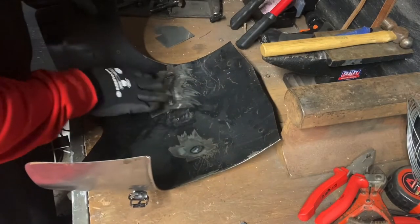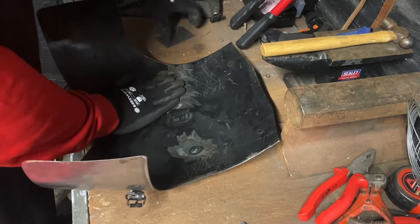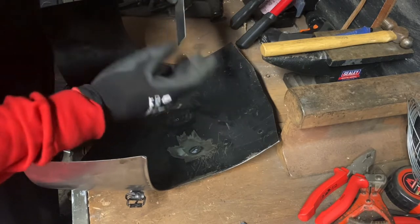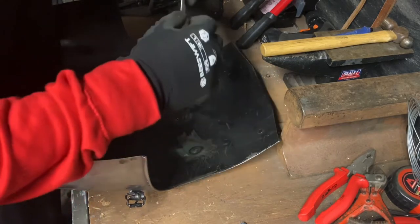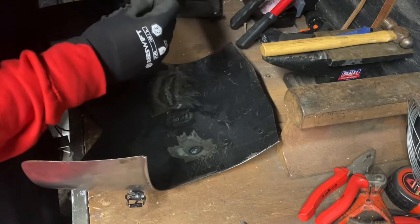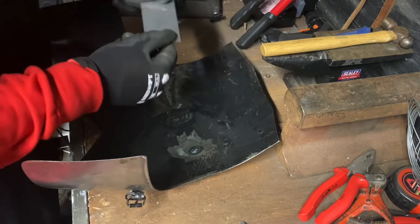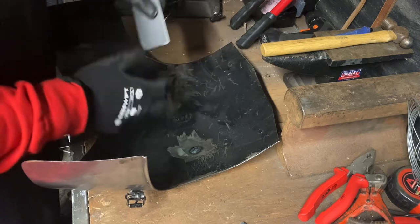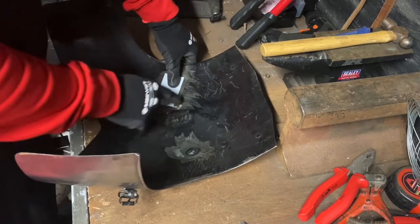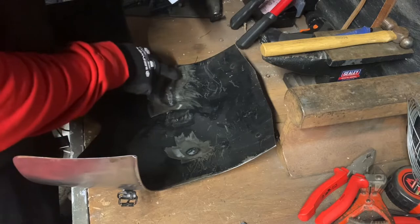What we're now going to do is add a supplemental plate to each of those welds, riveted on, so it's got a little bit of extra strength. The plates I'm going to use — I'll cut some pieces here — it's 304 stainless, one millimetre thick. 304 stainless is stronger than mild steel. Obviously it's not hardenable, but what it will allow us to do is form and bend it to the inside shape of the cuirass so that it holds form.